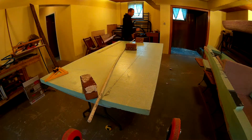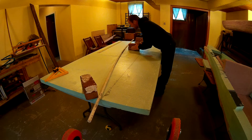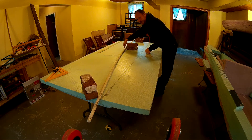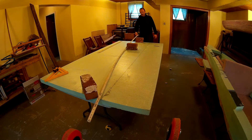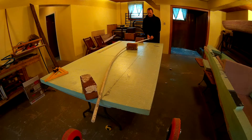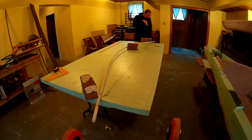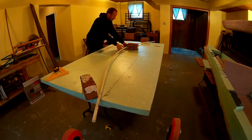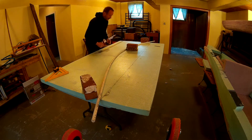In the middle of the boat is where our 28-inch dimension is found. The bricks are set so that the mark is visible, and you have to align it so that when you're looking at the outside of the pipe you have a straight sight down onto that mark. Here at the stern, it always gets interesting when you're making a pipe bend. You use your gravity clamps again — bricks, paint can, anything like that works — so I can see right where it goes off the foam, and in the middle I can line the bricks up so I can see my marks.